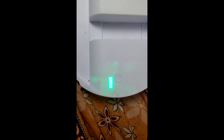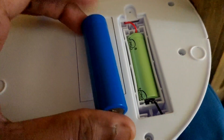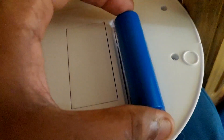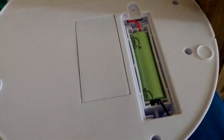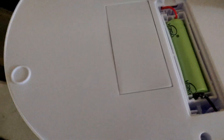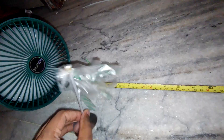The second obvious thing is that it's too weak even on its third level. So I immediately opened the back to check the battery and found one of the strangest things I've seen recently. They put a 14500 adapter inside an 18650 slot. They didn't even put battery connectors — they directly spot-welded the battery to the wires. This is not the case with products ordered directly from AliExpress, as you can see from user reviews — those actually came with a proper 18650 battery.